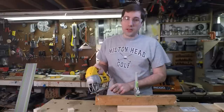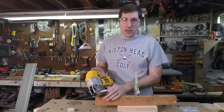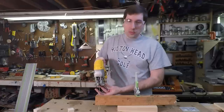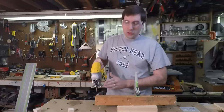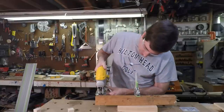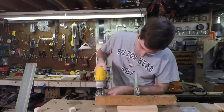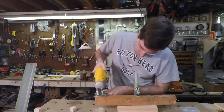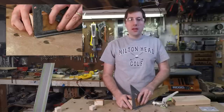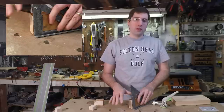I've switched out to a longer blade so I can cut this two by three. This is just a Bosch aftermarket blade — nothing special, just happened to be Bosch. I'm going to cut this to show how the blade tends to bend when you cut a long board like this, and your cut won't be perpendicular to the face. When I put my speed square on here, you can see this is not a perfect 90 degree cut. That blade guide is not doing a sufficient job supporting the blade and keeping it perfectly perpendicular to the shoe.